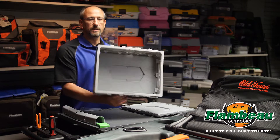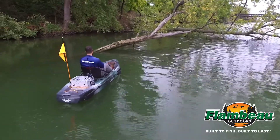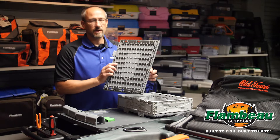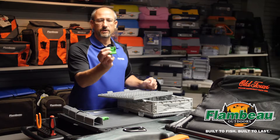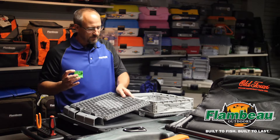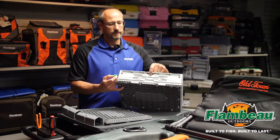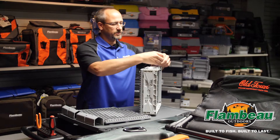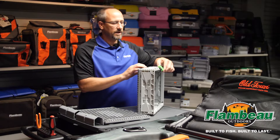The upper compartment is built and ready to accept a lid. We have the hinge pins and the latches that came with the part. We'd like to assemble the latches to the lids — this only requires a simple snap. You're going to see three squares lined up inside there. Put those onto the hinge features, making sure the latch is on the opposite side of the hinge. Turn that around, put this feature in, and snap that into place. Now you have a latch attached to that side.